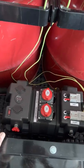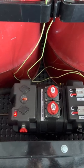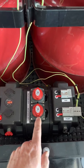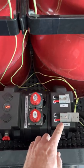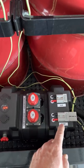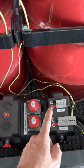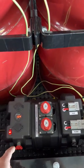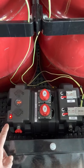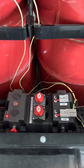We have our battery — just a battery pack I acquired. It has a little voltmeter built in so you can see the condition of your battery, and some charge points. This is how we're controlling the pump: it's an isolator, goes through a fuse and then an Anderson plug to the pump, with a spare point for charging. We're going with an AC charge model and not solar panels, because where the trailer is based there will always be power available.